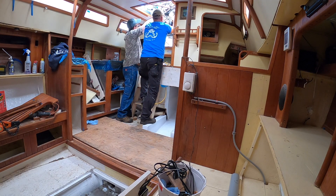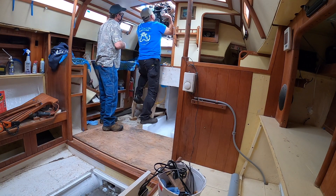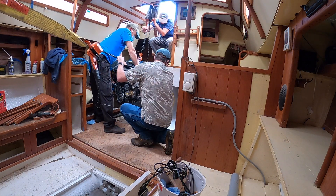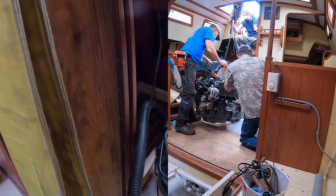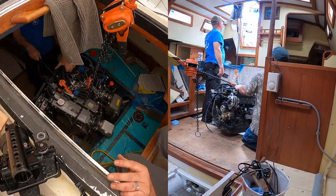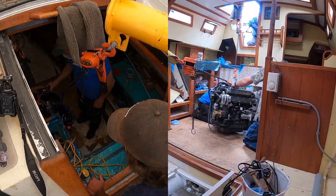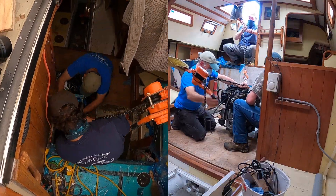Okay, so just like that — once it was set in the cockpit it wasn't too bad. We got some sacrificial pieces of wood to protect the companionway on the way in and down. It was a smaller engine, had a little more wiggle room. We had the students measure a couple of different times. We had built the plywood platform that we're standing on. The trouble with that forklift is it can't come in all the way, so we have to pull the engine forward with that strap and come along. The mast was out, so we put in this beam through the deck and down into the mast step, so we had something solid to pull that engine forward on. Originally we were just going to set it down on that plywood foundation and re-rig an A-frame, but we decided it was so easy to just put the mounts back on and swing it in a nice gentle U and actually set it right on its mounts, then ease the tension on the line forward and let it go aft so we could get it sitting in place without having to re-rig it. It was just perfect.